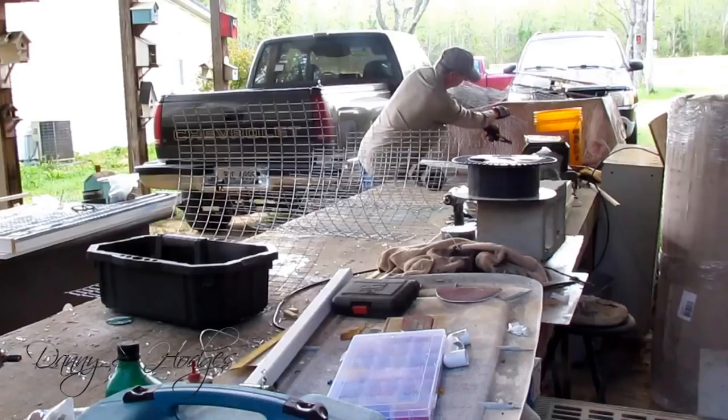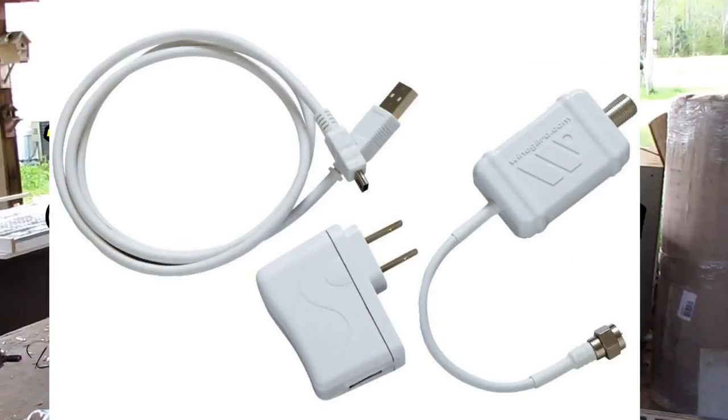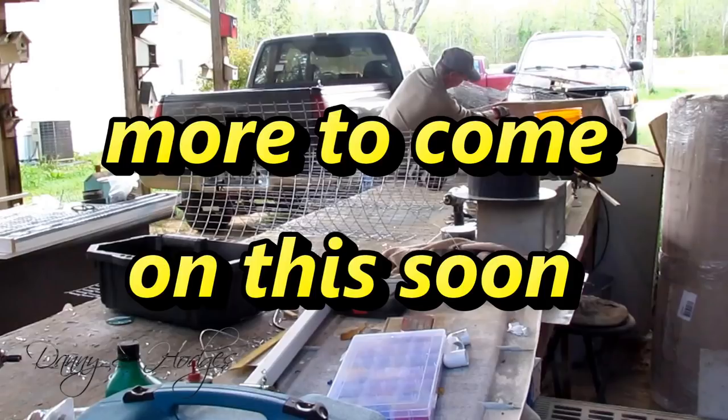This video is for TV antenna installers. The ultimate TV antenna has a really strong signal from the get-go. You can't use a two-piece booster with it — well, you can, but the signal won't be as good. You can't pair a big powered booster with a big powered antenna. What works best is the LNA 100, a one-piece booster. That antenna design eliminates the need for a booster for a lot of people.